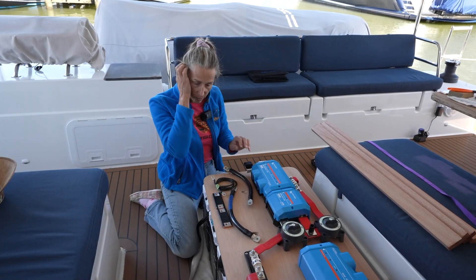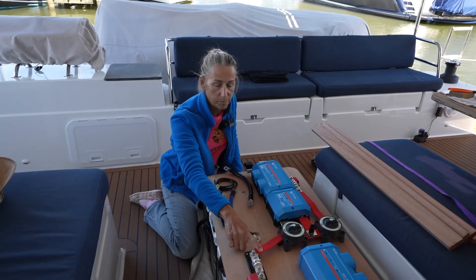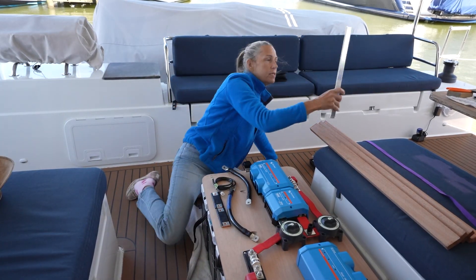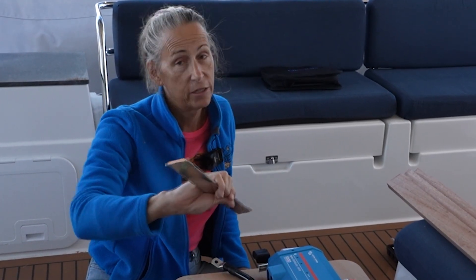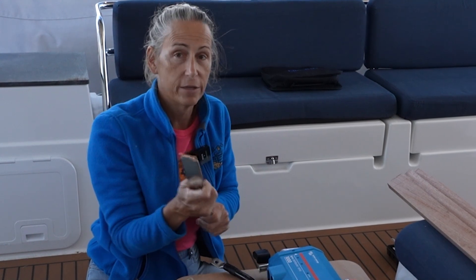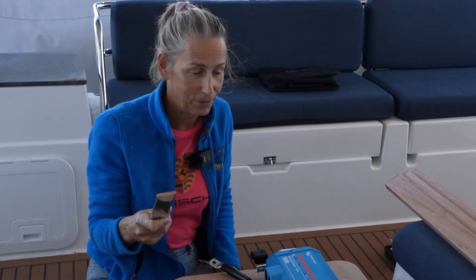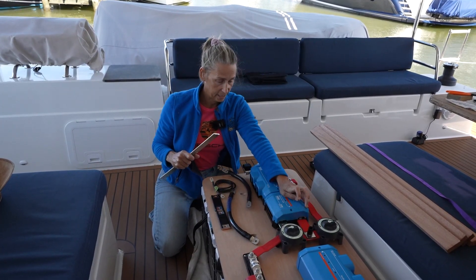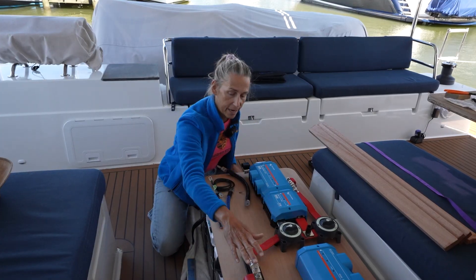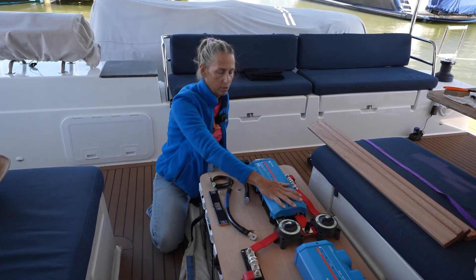It's been quite a lot of work to get to this point. The bending of all these bus bars has really been something. What I'm using is basically 800-amp bus bar — it's big, it's thick, it's beefy. It takes a grinder to cut it and some pretty crazy tools to bend it as well. For this stuff I didn't have to bend it much because it's just the connections between the switches and into the shunt. We have 400 amps here, 400 amps here — they come in together for 800 amps out into our distributor.